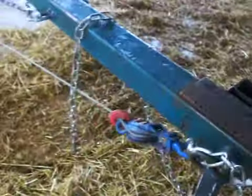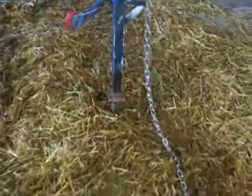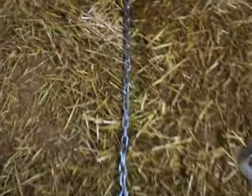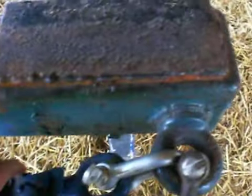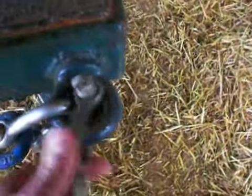Now, this particular arm is set up with the idea of one ox team. We had tried the mill with individual oxen, 1 ox on each arm, but we found that actually it's better to have a team of oxen, 2 oxen with a yoke. So this is a chain that comes back all the way to a hitching point. Now in effect we have another mechanism here which I'll come to later, but if you go with 1 team on the shaft, then you can hook on directly. So this is hooked on directly to the shaft.